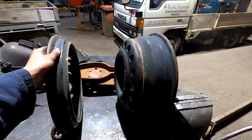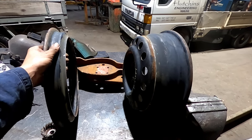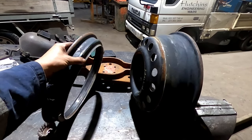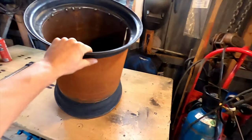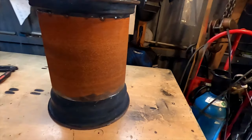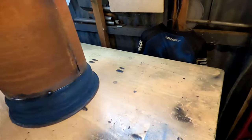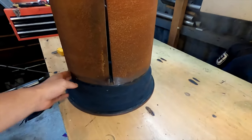I've cut it apart — I used the grinder and the lathe to mark it. Now I need to put 340 millimetres in the middle, so I'll roll that ring up. Back home now, I've welded this big band in here — it's pretty deep dish now. I've got to go around and press all this in and tack it together. This gap here should hopefully pull up once I push all the rest of it in.